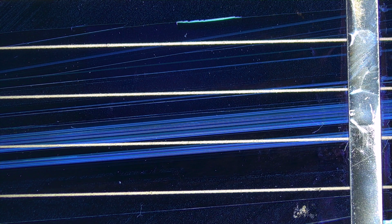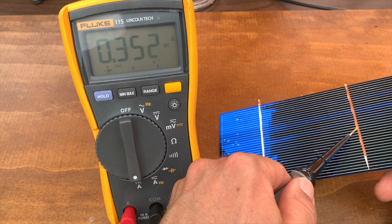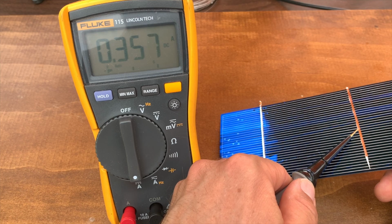Here's a zoomed in view of a solar cell with a lot of fractures in it. Most of these you can't see without magnification. One of the big issues with these fractures is that they can inhibit electrons from efficiently reaching the collector wires, and the cell's producing ability is diminished. These microfractures can be caused by things like pressure on the panel, a manufacturing issue, or from the expanding and contracting of the frame.